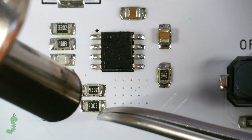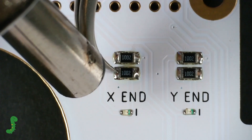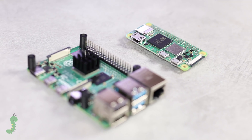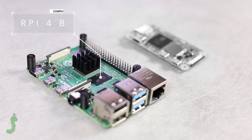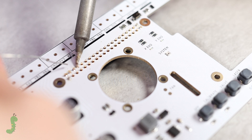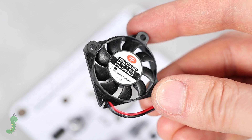As I mentioned before, I was overly optimistic when I chose the Raspberry Pi Zero for this project. I soon realized that I needed a lot more power to use OpenCV in real time, so I replaced it with the most powerful Raspberry Pi model available. Still, real-time image recognition is CPU intensive, so I had to install a fan to control its temperature.